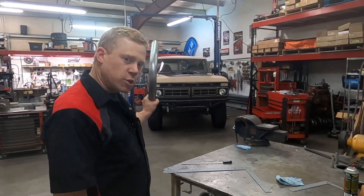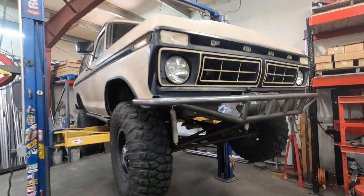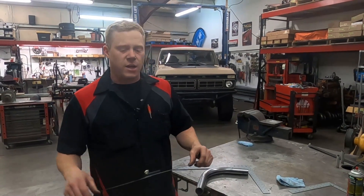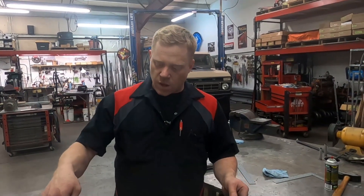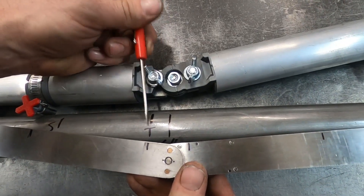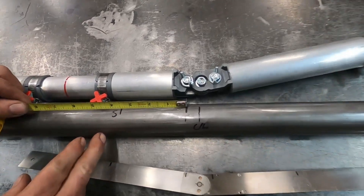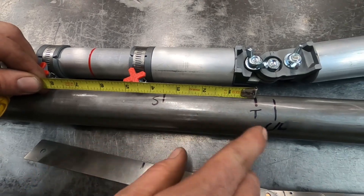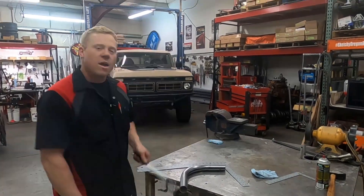In the next video we're going to be doing a tube bumper on the Bronco here because that tube bumper is old and destroyed and needs a new one. We're obviously not going to be using 90s — we're going to be using this angle finder and the same principles. Whatever the angle is, the contact point is the tangent of the bend, and we'll use this offset to figure out where the start of the bend is, so every bend will be right the first time. Make sure to like the video, add a comment, and subscribe to the channel to stay up to speed with 911 Motorsports.